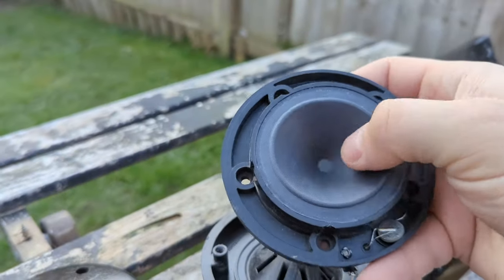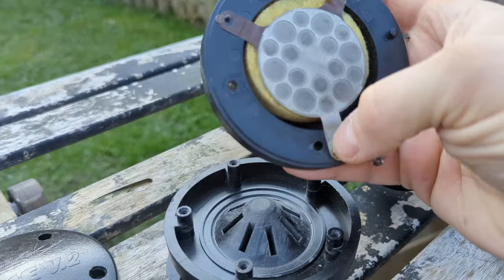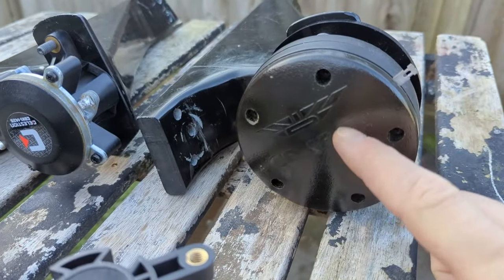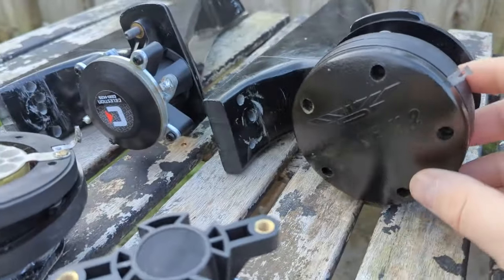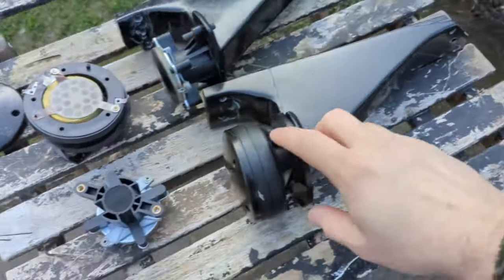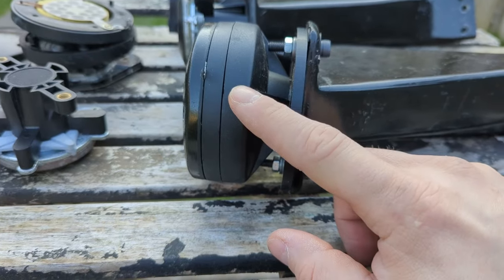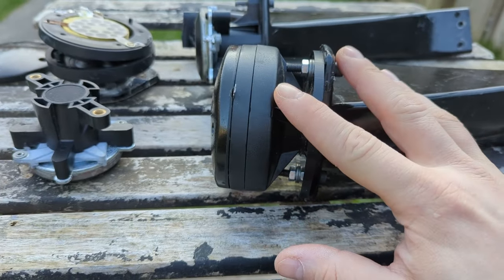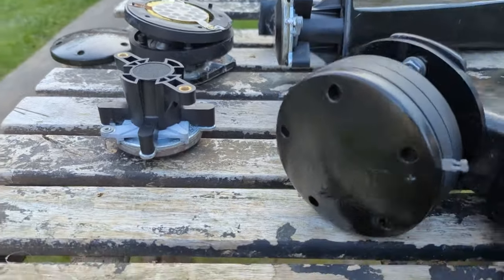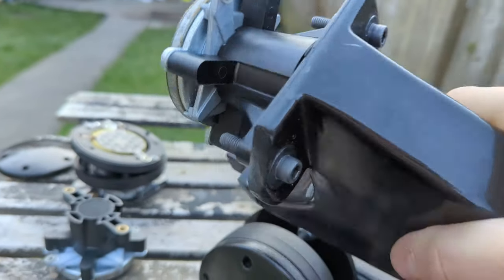There's a paper cone inside and it just crackles. I put the spare new ones in and inspected them - took everything apart and there were no issues. I determined the crossover point for these at about 1kHz, 24dB - optimal, because everything below that the distortion rises.